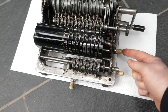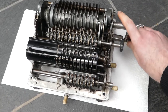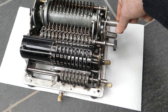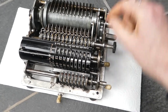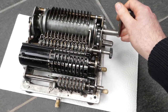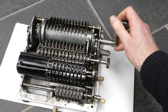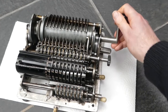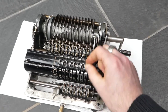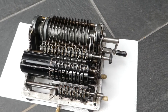When you push this in, the input will be cleared when you turn the crank. You can actually feel that when it does the addition — at this point you hear these clicks. That's simply because the input pins are moved forward rather than just shifted forward; they actually move past the alignment mechanism that you normally have when you set them. That clicking is what you hear when you turn the crank in that case.